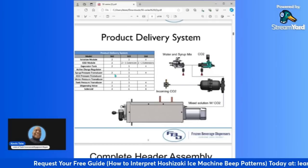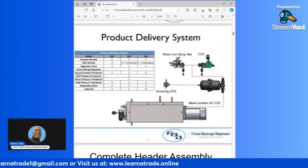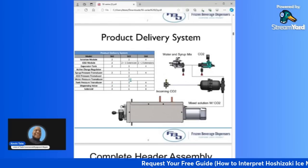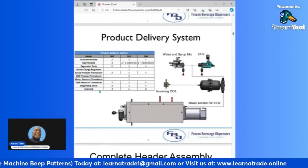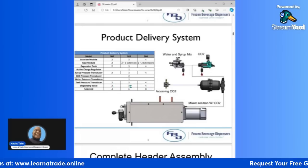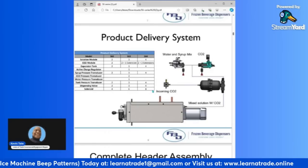But you have 2 of those transducers on the 562, you have 3 on the 563, and you have 4 on the 564. Your CO2 pressure transducers, you have 2 on all of those. So there's 2 transducers on all of these models. Your water pressure transducer, you have 1. Your tank pressure transducer, you have 2 on 562, 3 on the 563, and 4 on the 564. Your dispense valves, you have 2, 3, and 4 for 562, 563, and 564. Your solenoids, you're going to have 4 solenoids on the 562, you'll have 6 solenoids on the 563, and you'll have 8 on the 564.